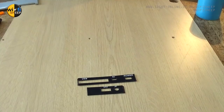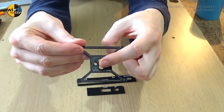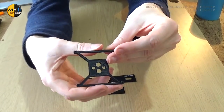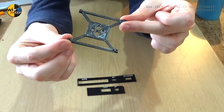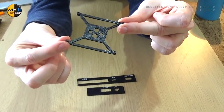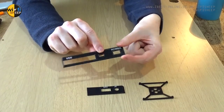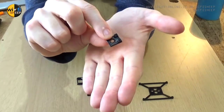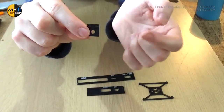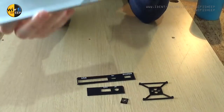I was never too happy about how the original Raspberry Pi went into the micro one kit - it used a series of nuts and bolts that was slightly crude, and the Pi was prone to coming loose. So I've designed a custom 3D printed mount which is a screw mount - you can fix through screws here or glue the back, and any Raspberry Pi plus board will fit by screwing down into the four holes. I've also printed a tiny screw mount piece for a micro USB jack, which has two screw mounts for the USB jack to fit on top.